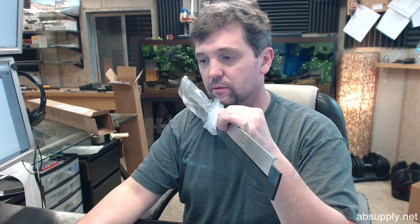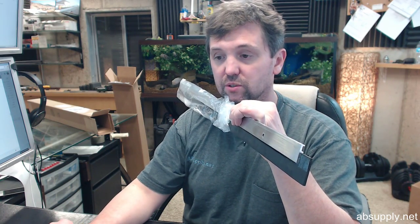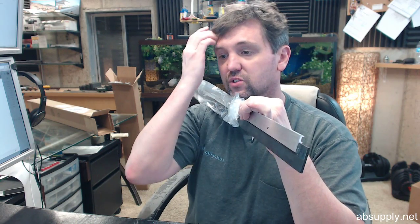There is a link below this video to a product brochure where you can pull up the 602 and review it against all of Reese's sister products pertaining to door sweeps. The 603 is the same item just with a vinyl insert. I couldn't recommend vinyl because of its low performance properties, but if economy was the most important aspect you would certainly look at vinyl. The really superior option I would consider strongly if you're looking for heavy duty is polyurethane — that's the 772 or 773. Polyurethane is off the charts high performance: excellent abrasion resistance, resistance to fungus, mildew, ultraviolet exposure, extreme temperatures. Polyurethane is ultra high performance and I would consider that very strongly.